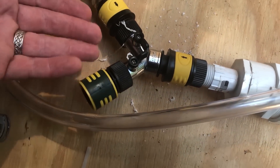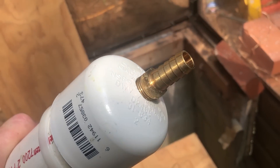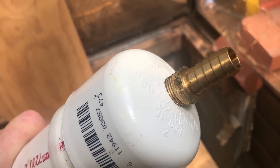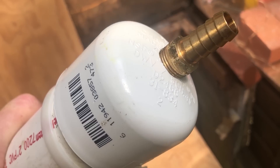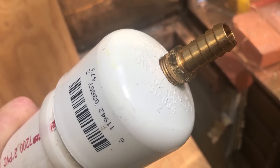So: a male-male-male T quarter-inch fitting, two valves, a quick connect on this end, and a hard-connect hose with hose clamp using the same tubing — that comes to the back Y. The Y is a standard garden hose Y with closed valves. Important: don't leave the water valve closed while pressurizing. Once the combination of fluid and air comes in the back it shoots through, gets agitated by all the steel wool, comes out, and makes foam. You only drill one hole — through the cap so the foam can get out.